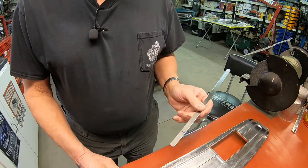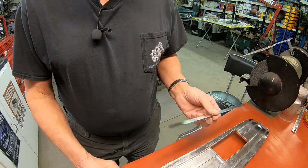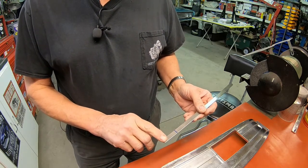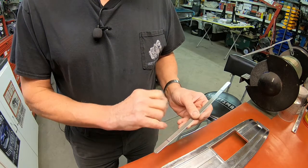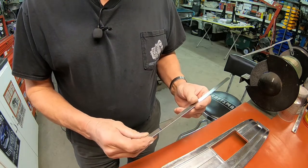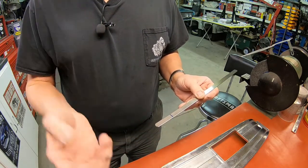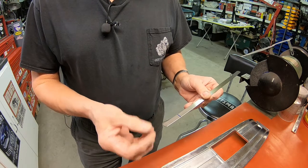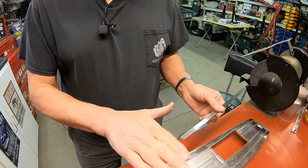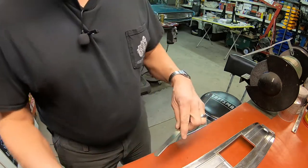And I use a piece of spring steel, and this is actually C1095, which is too hard for me to drill or to shape. So I'm going to cut the two pieces off that we're going to use, and then heat it in the oven to anneal it so I can shape it and drill it. After we're done getting it how we want it, we're going to re-harden it back into a piece of spring steel so that it'll hook under there and hold everything the way it's supposed to. So let me get this cut off.